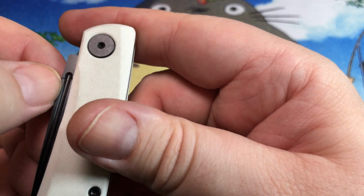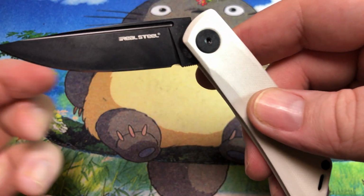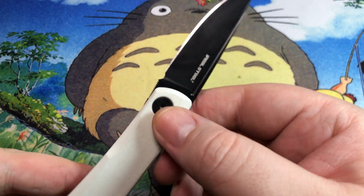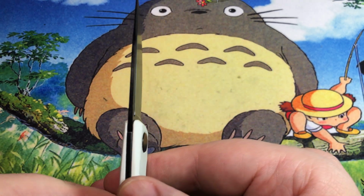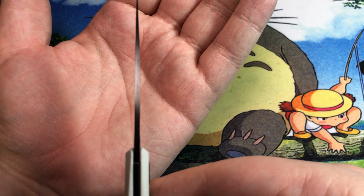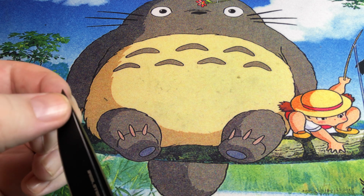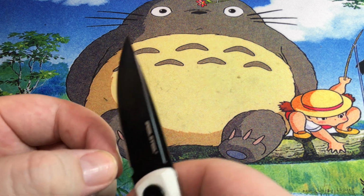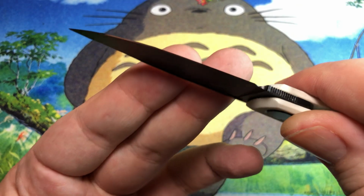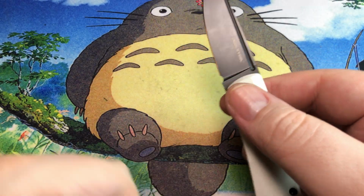And they do have a matchstick pull / fuller that runs almost the full length of the blade. Kind of an interesting way to go about it, but it works out quite all right. You can see we have a very, very nice slim blade stock, so it's super nice and slicey. And it's fairly darn thin behind the edge. I did sharpen it up to a 17-degree edge and kind of mirror polish that with some lapping films and strops and whatnot.